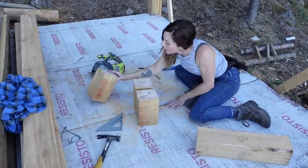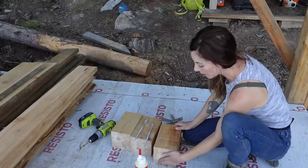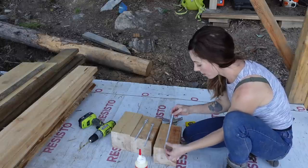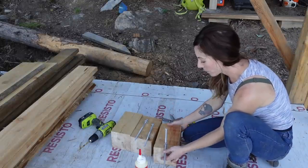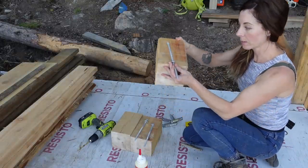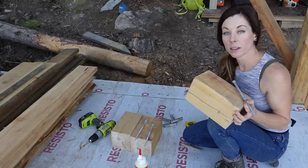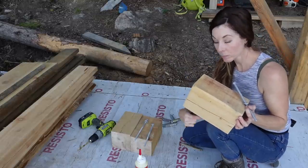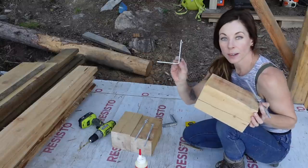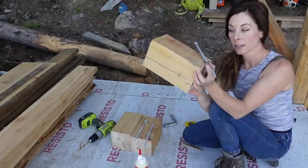Two, three. Glue it and screw it, baby. I brought some wood glue. I'm going to glue this. I've got these long screws, and I'm going to pre-drill and screw them in. This is how it's going to go, because the weak point is at this point, like to go like that. So I'll do that. And then if I need to afterwards, I will add a little wind bracing or whatever. But in the meantime, I have these, so I can always put these down like this for now